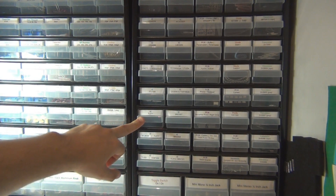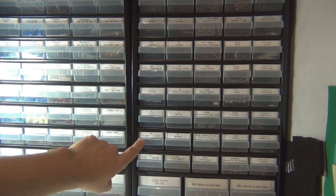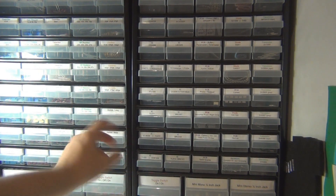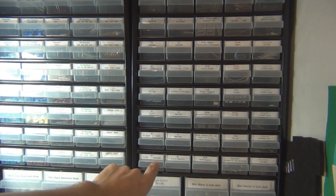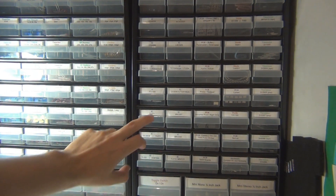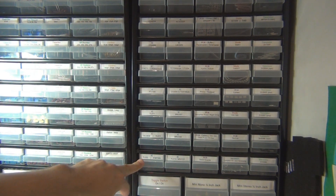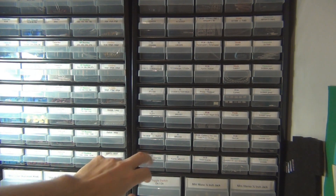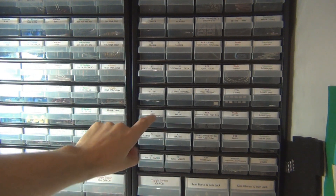The TL series are used quite commonly. TL071 and TL072 are used quite a bit - you could stock up on those without too much trouble. I wouldn't bother with the ICL8038; that's a specialty chip you only ever use in one pedal that I can think of. Same with the ICM7555 - I got that in specifically for a build. TL022 is not as popular as the TL071 and TL072. The TL074 is used quite a bit as well, so it fits in the same category as the TL071 and TL072.